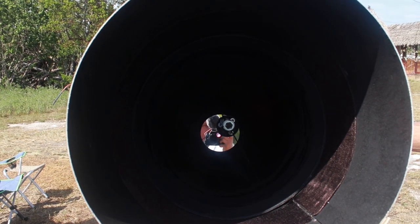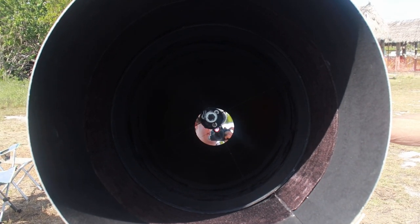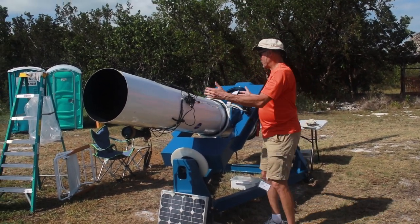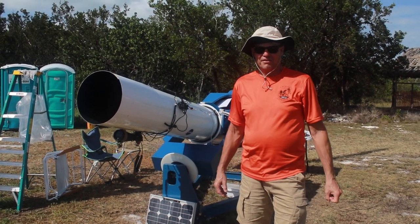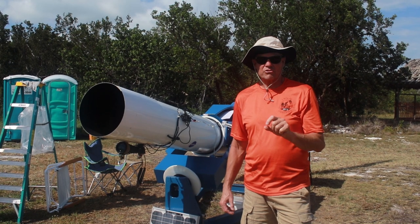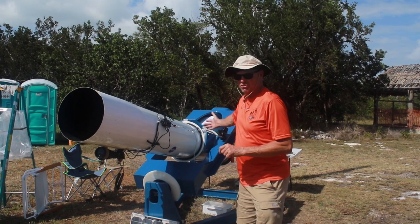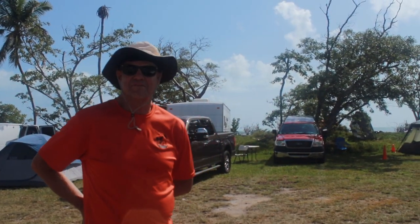There's flocking, blackening, and baffles. No stray light at all — even on a bright sunny day you can see light around the rim but nothing else inside the tube. Installing the baffles was a challenge: I had to literally crawl inside the eight-foot tube to set them with super glue and then caulk them in. Each baffle was routed from G10 fiberglass on a router table — every baffle is a different size according to a formula based on ray angles, and each must be precisely positioned and sealed in place.